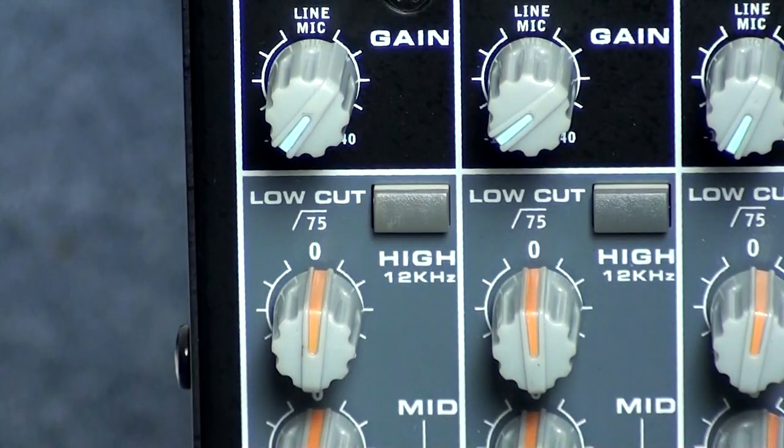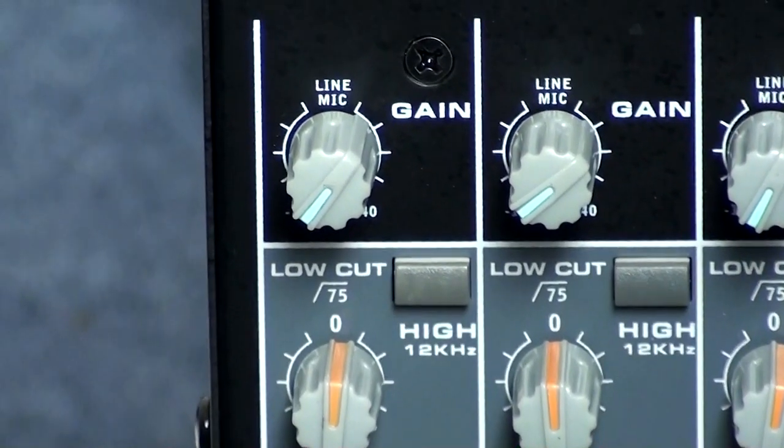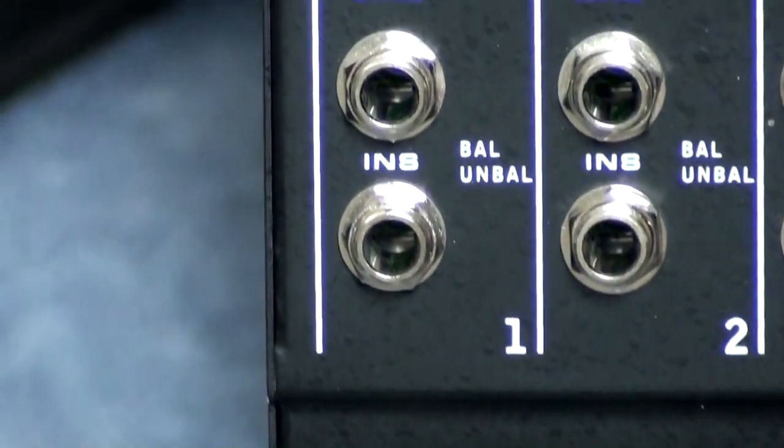You won't generally need under 80 hertz for vocals. A lot of high-end or good microphones will have an 80 hertz low-cut filter. This has a 75, which is perfect for vocals. So, if you want to get less boom in a vocal, depending on the microphone, you can use that. And it will still sound warm and big, it's just the vocal range doesn't really cut in below that range there, so that's cool.